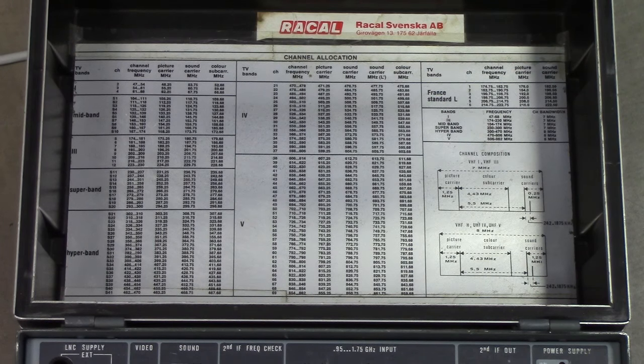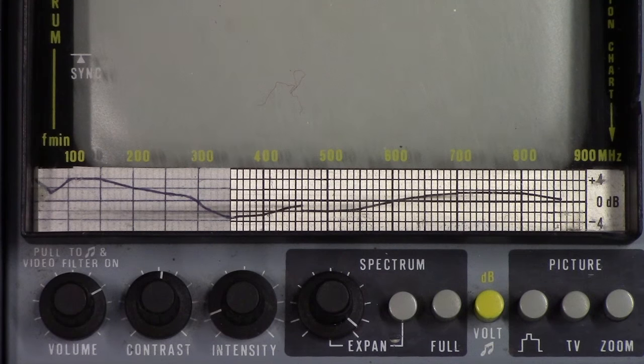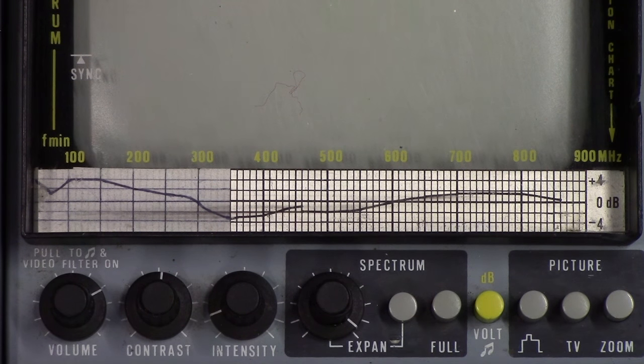Inside the lid, you actually get this quite handy radio frequency and analog TV cheat sheet, which I've been looking at quite a lot. It's very useful. And here's a close-up of the, sadly, way out-of-cal frequency response of the unit. It seems to be somewhat accurate up in the higher frequencies between 400 and 800 MHz or so, but below 400 MHz this graph really doesn't hold true. However, someone has obviously edited it below 350 MHz, so perhaps it is responding as per the real graph underneath this ballpoint pen marking, but I'm not going to try and take that apart.